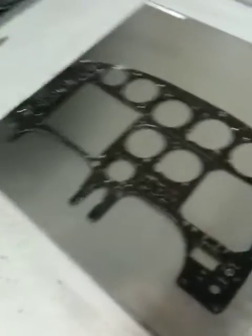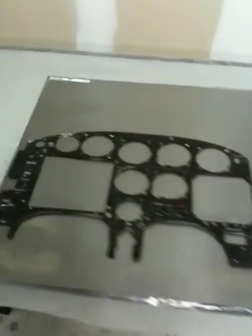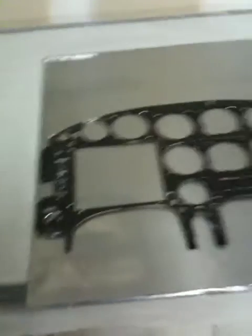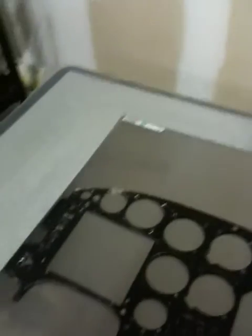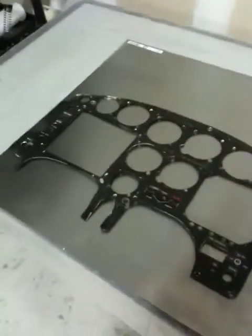So tonight the job is to actually lay up on this piece of aluminum — I'm going to make a new fiberglass panel. I'm going to do four plies of fiberglass covered by one ply of carbon fiber on the outside, which will have two effects: aesthetics — it's very pretty — and also strength. That's tonight's project and I guess you'll see more later.